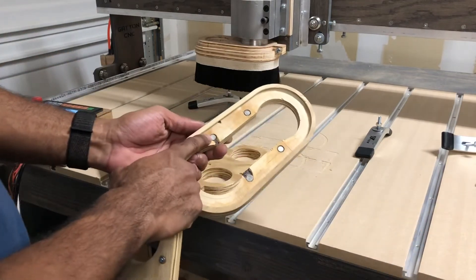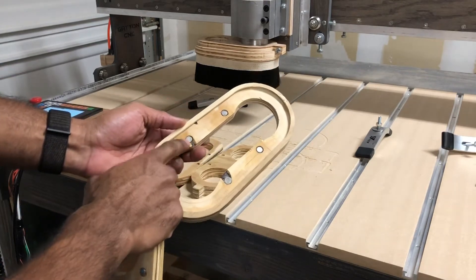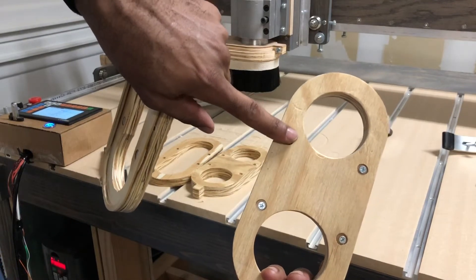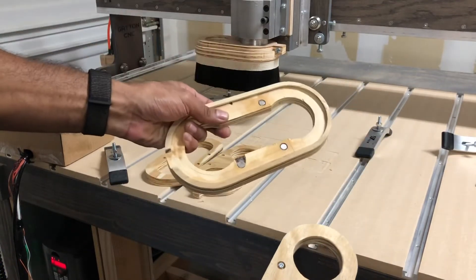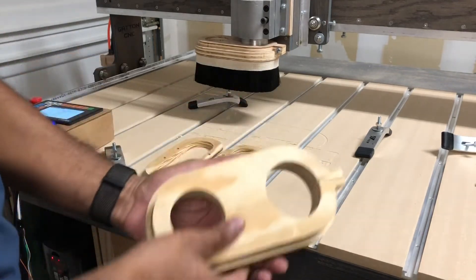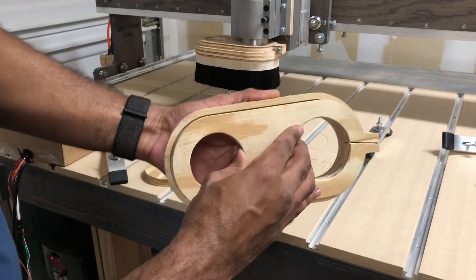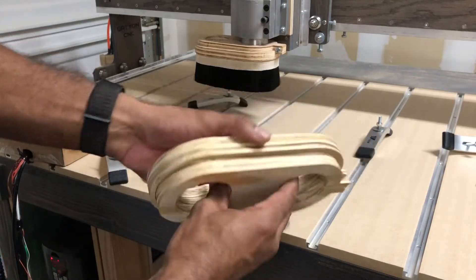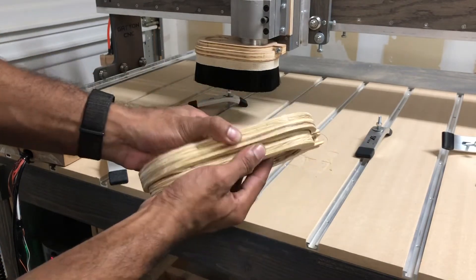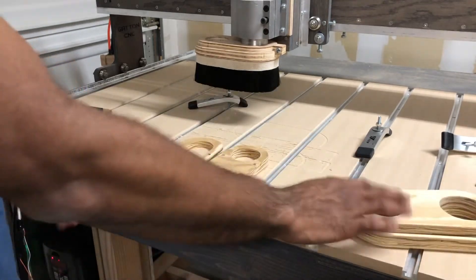With this one I did have the rare earth magnets under there, and then I just used screws on this side so I could adjust them up and down to meet the height in case I didn't get it machined right. But what I found is when I made it I made a little too much play, which means that when you have a little bit of force this way it opens up — and you'll see that in a video I have of that one failing.